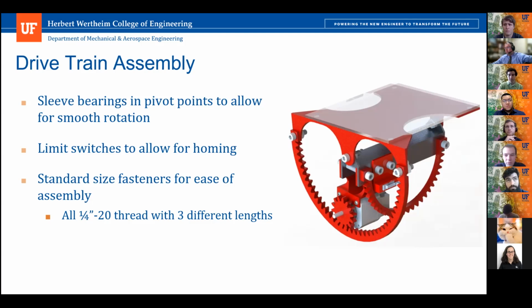There were a few instances, while we were testing the controls code, where the motor hit a physical limit in rotation, and the full torque of the motor spinning was putting stresses on the gear, and it never failed. We did reprint a few times, so it's possible that if that happened multiple times, it could eventually fail. But our code eventually put in fail safes, so it should never put stresses directly on the gear like that in actual operation. Okay, great. Thanks.